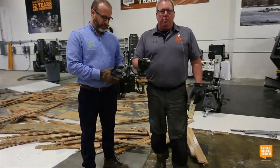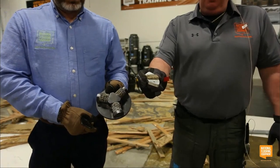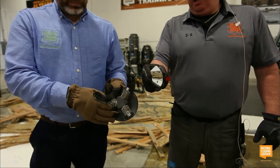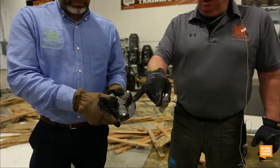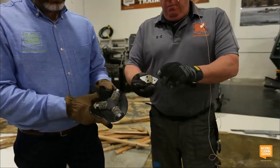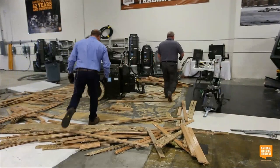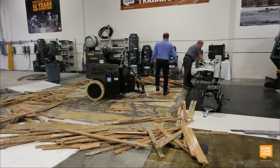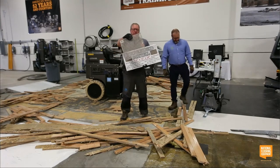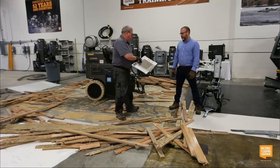These one-inch carbides are an example of what happens to a lot of your tooling. The glue, when you take a break to go eat lunch, turns to a very hard substance and now it stops working. You should have an extra set you can change out. The biggest question I get is: Dave, how do I get this off? I'm going to show you. I bought two plastic buckets at a local home improvement store. I put an expanded metal screen on top of one bucket. I bought this product called adhesive removal. I'm going to fill this bucket up with my tooling in it, pour in the adhesive removal, and let it soak for a while.